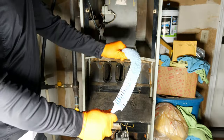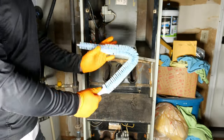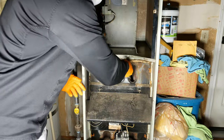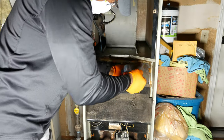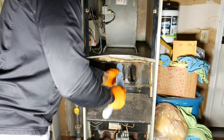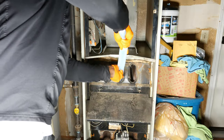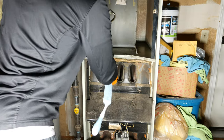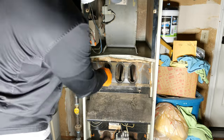While I was in here previously checking out the blower motor, I cleaned the internals of the furnace because it was very filthy. I scraped off quite a bit of surface rust from the heat exchanger using a nylon brush from a local hardware store — I believe it was a dryer exhaust duct brush. I couldn't find a proper furnace brush in stores and didn't have time to wait for one to be shipped.